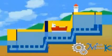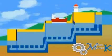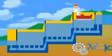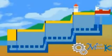As this is locked up, this valve is closed, and again this valve is opened up. So the water from here again goes to this lock, and then it gets lifted up. Let's see that. Now again it happens this way, and once the levels are the same, this lock gate opens. The gate opens and then the ship sails forward. As it is done, this valve is closed, and then the lock gate is closed. As this lock gate is closed, again this valve is opened up. As this is opened up, the water level drops within this lock, and then the ship moves forward again. So the level rises and the gate opens, and then the ship sails out. So this is the basic working of the Panama Canal lock gates.